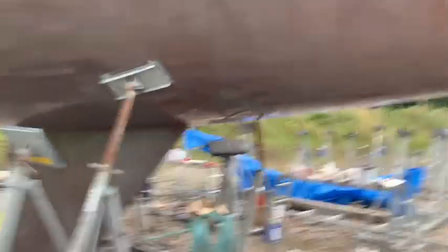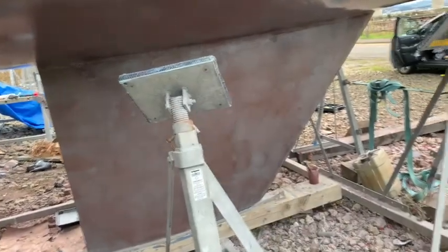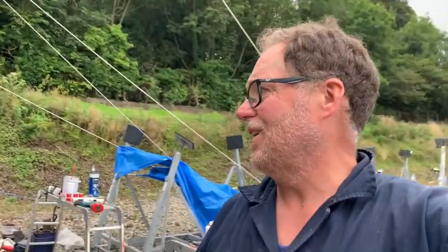This is the second coat of our homemade copper antifoul. The keel hasn't had a second coat yet but it's pretty consistent. The first coat was really patchy — you can see on the keel — but this second coat is much better. We changed our technique. We were using big rollers — massive rollers — and they were incredibly hard work. We were mixing up too much at a time, and by the end of one kilo of resin it was going off before we had a chance to get it on the boat, which made it go on too thick. Now we're mixing in batches of about 250 grams of resin plus hardener, and that is making a huge difference.